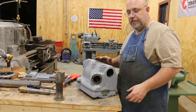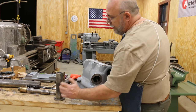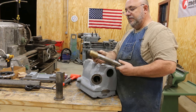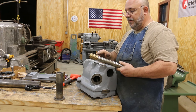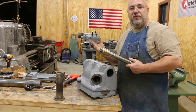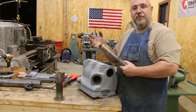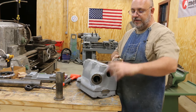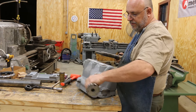With this back together, now we're ready to start getting things assembled. First I'm going to get the crank put in here. You've got two holes — the one on the left is for the crank to fit into the handle that turns, and that is attached to this worm gear down here. The worm gear is made out of brass or bronze — a soft material. The purpose is that it engages into the rack on the bottom of the spindle, and being brass or bronze, it's softer and will wear instead of the actual spindle bearing. If it did wear out, you could order a new one from LeBlond and replace it. Mine's in pretty good shape. On the end there's also a thrust bearing that helps things turn freely in there.